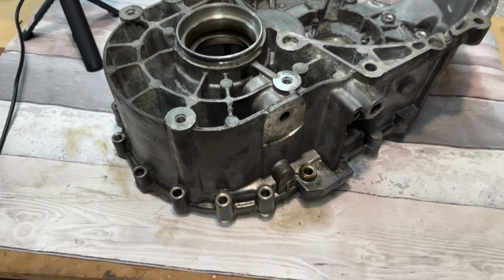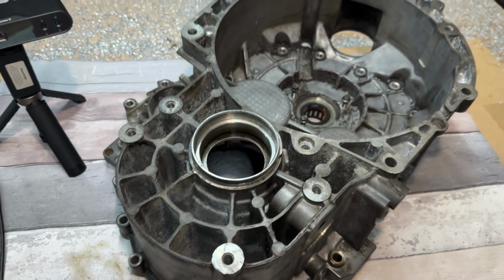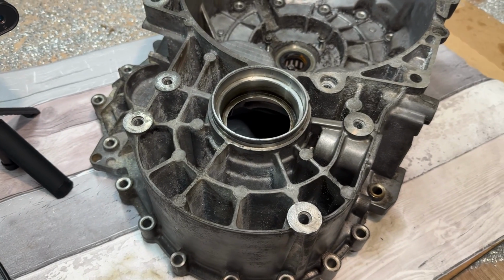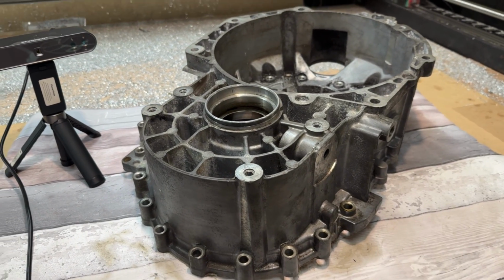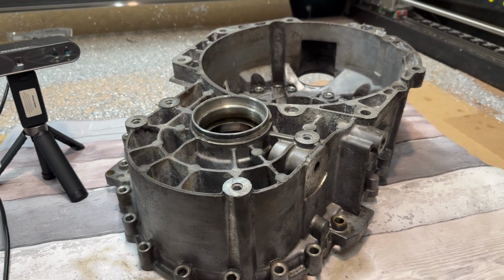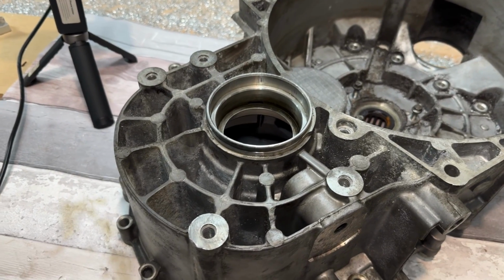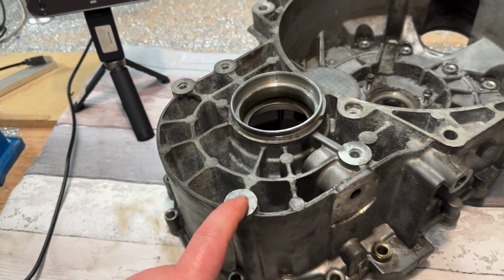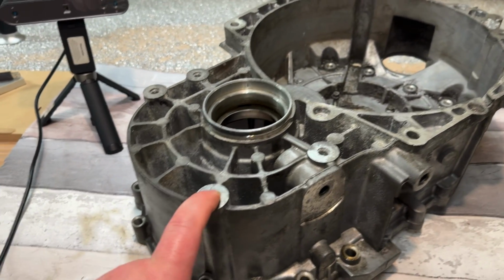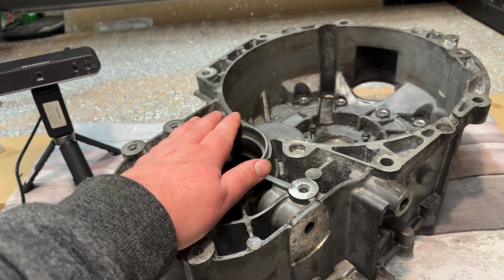But we've got a couple of issues. His Caddy is front wheel drive. This is originally a 4-wheel drive gearbox. These typically come up cheaper than the front wheel drive ones, so it makes more sense buying these if you can run them front wheel drive. Nobody, as far as I can see currently, makes a front wheel drive adapter of this.